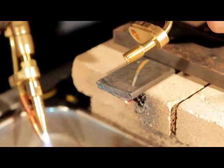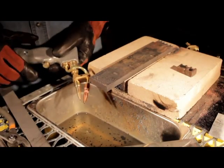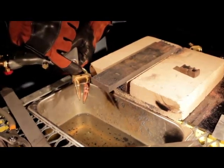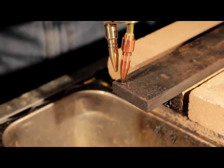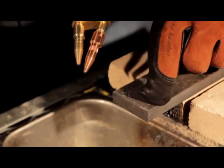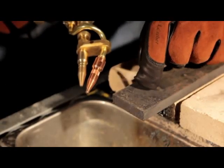Now we're going to show you how to use the overcutter on thicker metal. We're getting ready to cut thicker metal, normally from about a quarter inch up to one inch — this is the overcutter. It comes out over the top. Heat with your number two, put your copper tip on. Keep that copper tip straight up and down, right down close to the metal. Remember, the closer to the metal on your cutting tip, the nicer, thinner, finer, and cleaner a cut you're going to get. On all thick metal, we have to preheat — remember that.